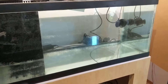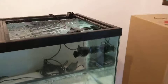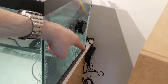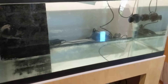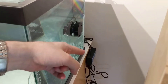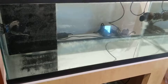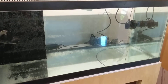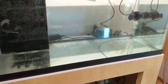If I have time I'll upload a video about that, because it looks like a lot of people are throwing these controllers in the garbage because they can't get them working. Quick explanation for the Tunze 7096: if you're having a problem flashing it, open up the folder on Windows where it gets installed. When it fails to flash, it drops a .pcy or .pny file in the installation folder.